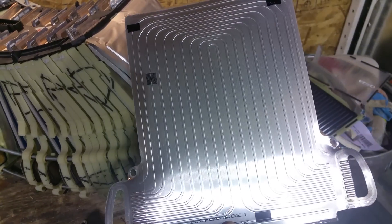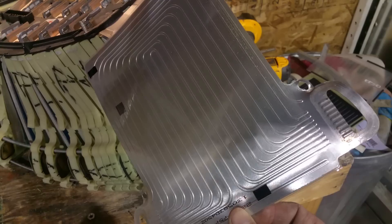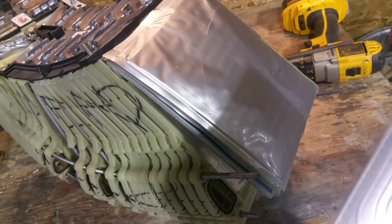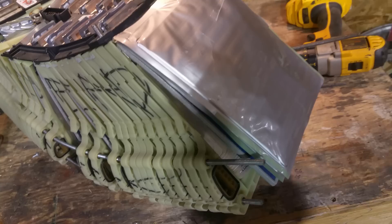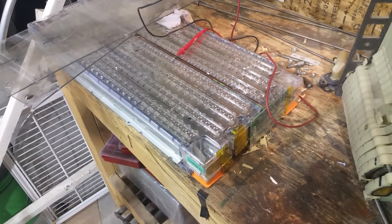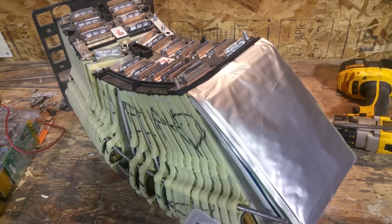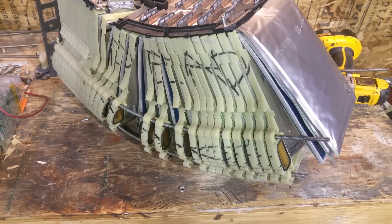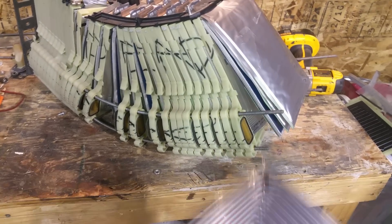Inside is the real party piece of the Volt packs — what I think makes them so good. You've got this large-format prismatic cell with large amounts of surface area and large anodes, which gives you capability for a high discharge rate. This was an approximately 15 kilowatt-hour pack powering a full car, so you need a higher discharge rate. Compare that to the Tesla module sitting right there — that's 5 kilowatt-hours but its discharge rate is much lower. I could easily pull 500 to 750 amps from that. For the same weight you can have double the power but about half the capacity — everything in life is a trade-off.